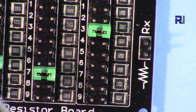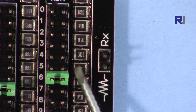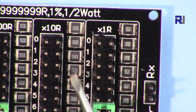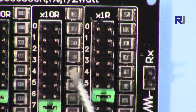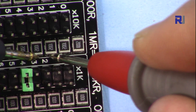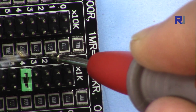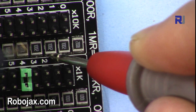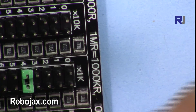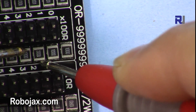This has very simple construction. All the values here are one ohm each. When you put it at two, the current will pass from the second one, giving two ohm. These are all ten ohm, and these are all hundred ohms — hundred ohm each. Once you connect it, you are connecting the path; these are in series, so that is why we are adding. Let me show you one of these 10 kilo ohm resistors.